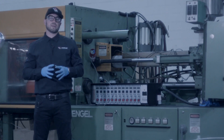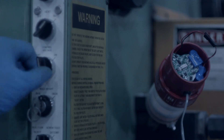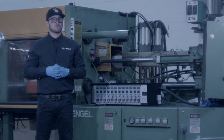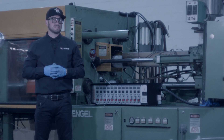Our product will operate while your machinery is in operation. When your machinery shuts down, our units go into a pause mode and do not deliver lubricant to your bearings. This is run through a dry contact to a customer-supplied PLC and or other device that allows the unit to know when your machinery is in operation.